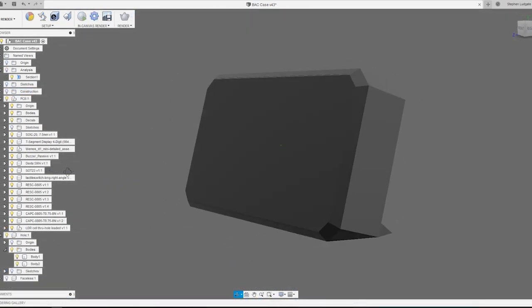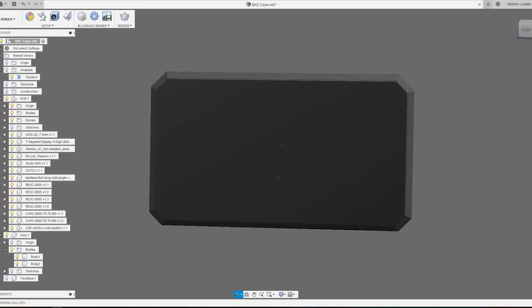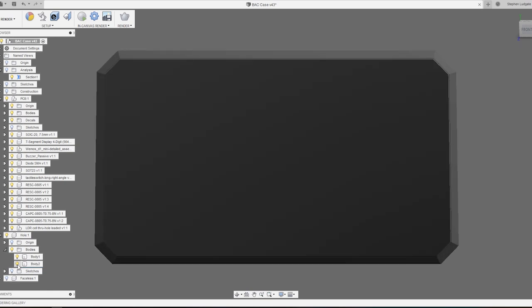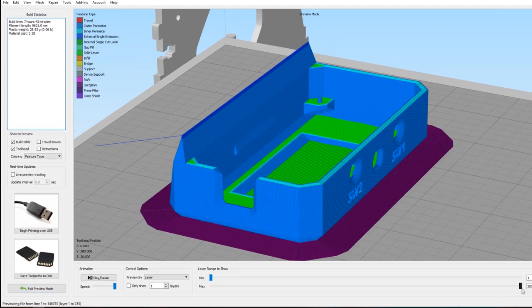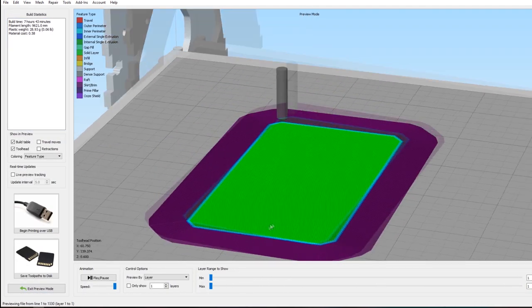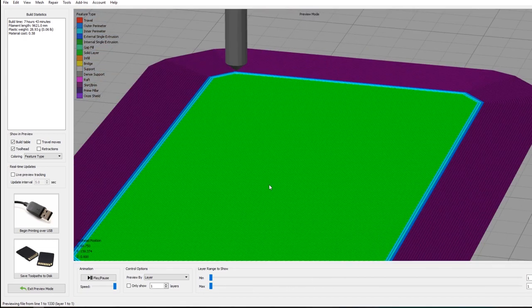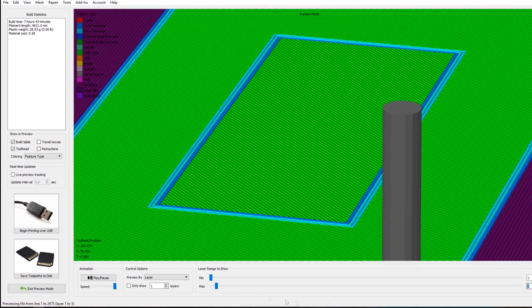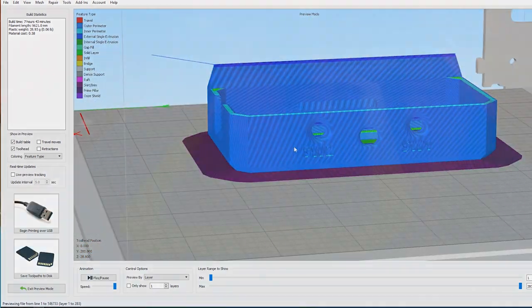Once I was happy with how it all fitted, I wanted to make a different version — the faceless version. Same PCB inside, but on the front there's no gap; it's one solid piece and you can see where the seven segment display will go. It's just a case of exporting the STLs into your favourite slicer. It prints face down so you get a nice smooth front face, and in the faceless version you've got two layers of plastic before it starts building the rest of the clock. You get a very nice time-lapse on the printer — this is a green version with the hole.